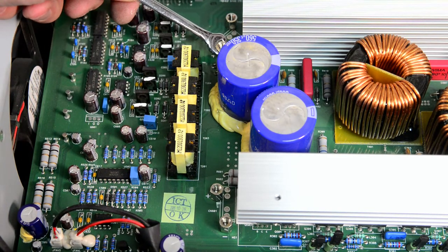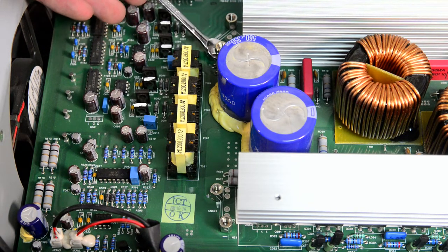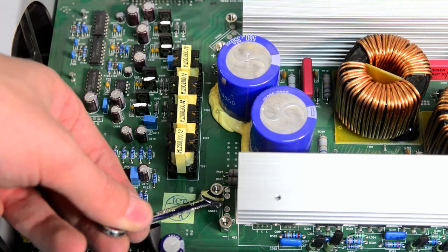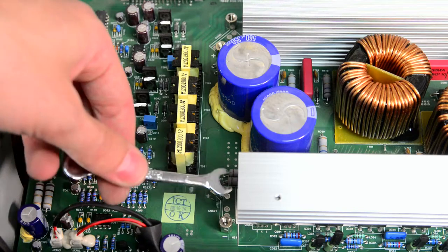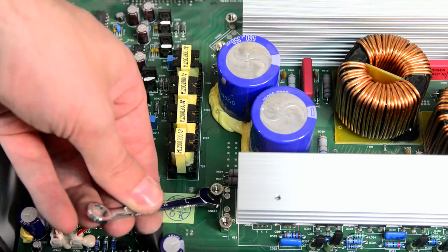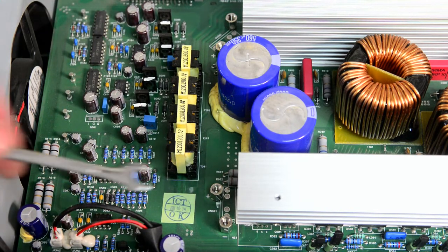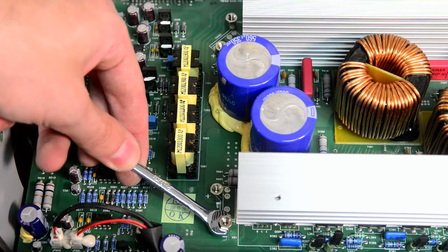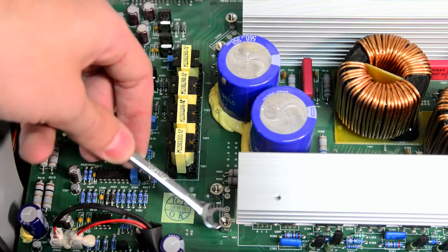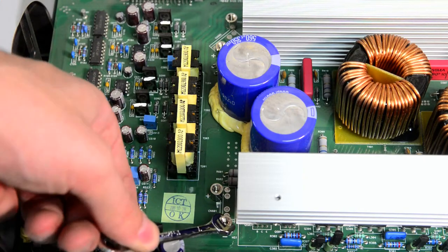It cannot change the shape or the frequency of your output. And with this unit you can program output frequencies in the range from 15 Hz to 1000 Hz. So you can, for example, generate 400 Hz mains power used for aircraft and ships and stuff like that. If you're designing equipment for those applications, you would need some source like this to validate that it can still be functional and work properly with different frequencies.